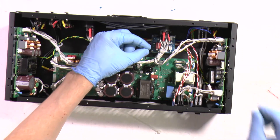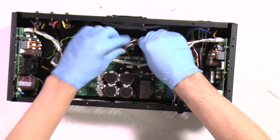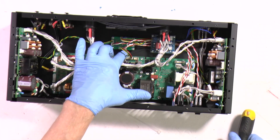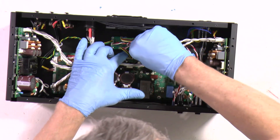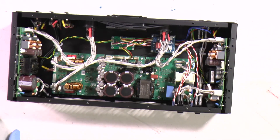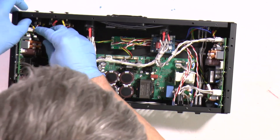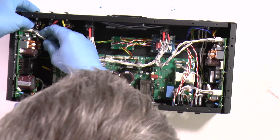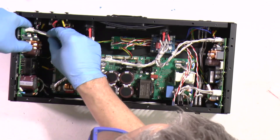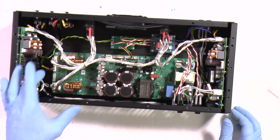Thermo sensor - we should place it between the plate and heatsink, where this connector is. Next, we should as much as possible separate inputs from outputs, so we do some tidy work here. Now the right side is fine, and it's fine here as well.